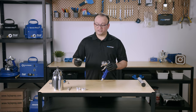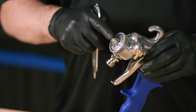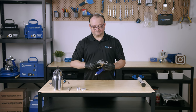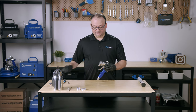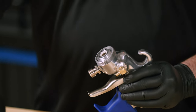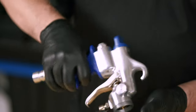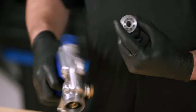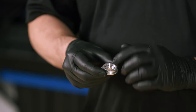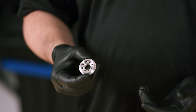Now we're going to grab our Fuji wrench and use cutout number 13 to remove the fluid nozzle. Here we have the air diffuser — it should slide right out. Whenever you take out this air diffuser, always make sure that on the back and perhaps even the front, there's no buildup, any debris, or any paint.